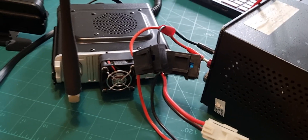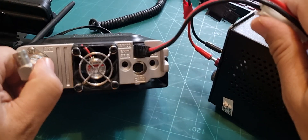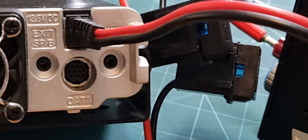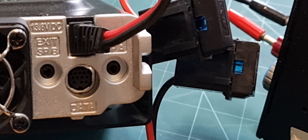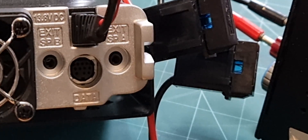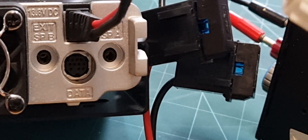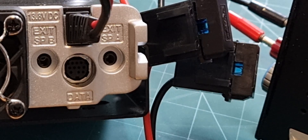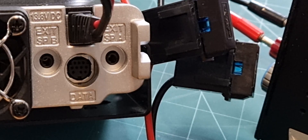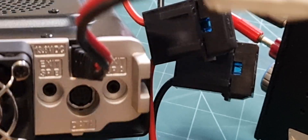Just to show you the connectors at the back: there's a BNC connector. You've got capability for two separate speakers — speaker A and speaker B. Then there's the 10-pin cable you'll use for PDM mode with the SCU-20 cable — there's a new one now, probably the SCU-59. Windows 11 will work with that cable but you just have to use an older driver.